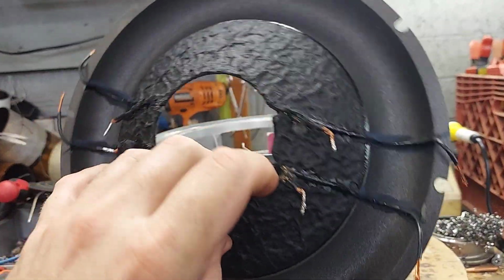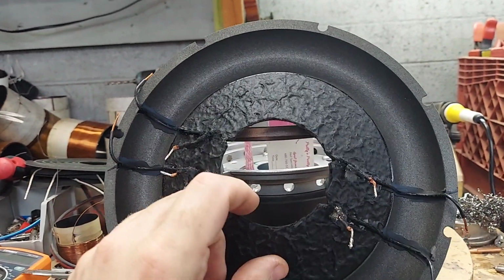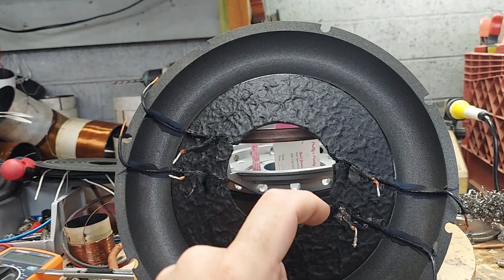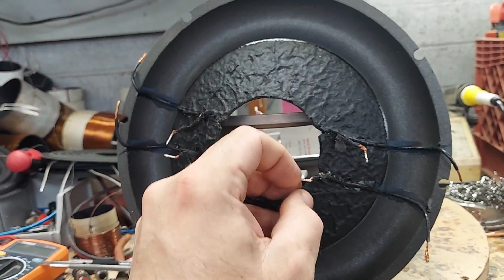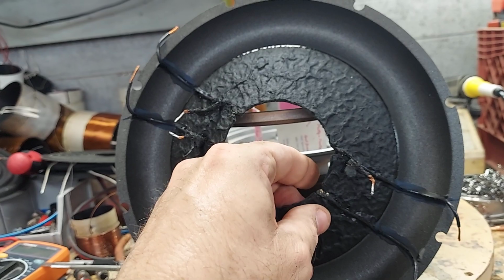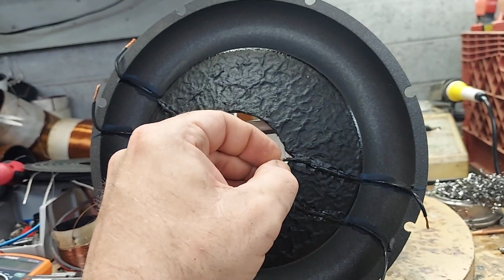So anyways, back to this one. I'm using the cone that I got out of the concept buyout, and what I did was I necked it out. The ones I'm using came as 2.5, and I just necked it out with a hole saw to 2 3/4, and then I made some notches for these to fold back up in there. What's really amazing about this glue that I'm using is it's still sticky, and I think this cone is actually 20 years old. It's been kept indoors, air conditioned, and it's still just fine.